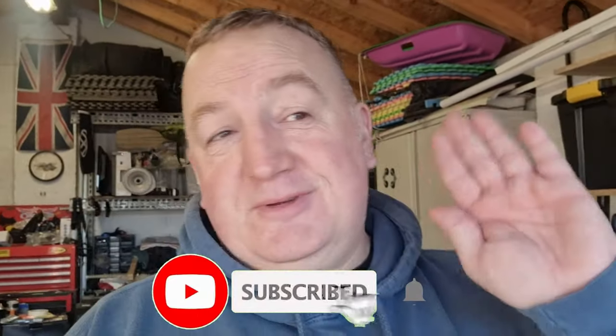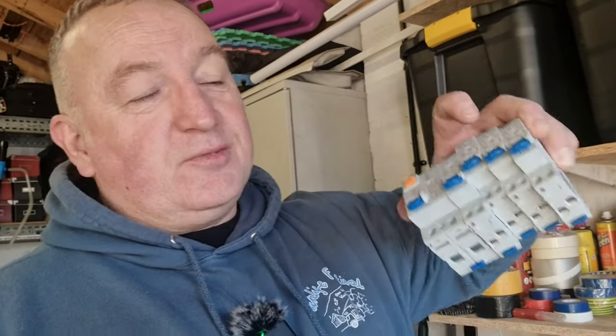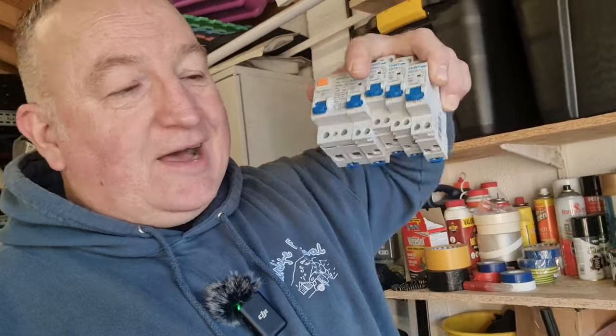While I was on the course, I kind of realized I need to put my hand up — my van currently isn't to regs. As some of you know, I am an electrical engineer, and it's a job I've been meaning to do but just never got round to. There's always one of them jobs. So this week I'm changing out all my MCBs to double pole MCBs and putting in the correct RCD.